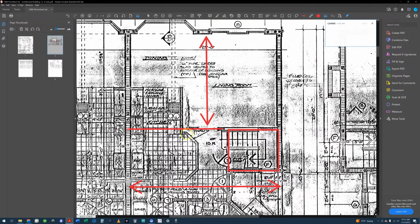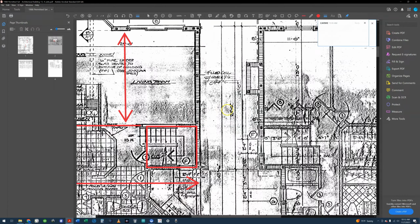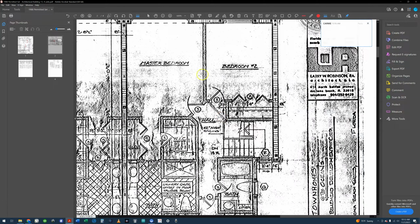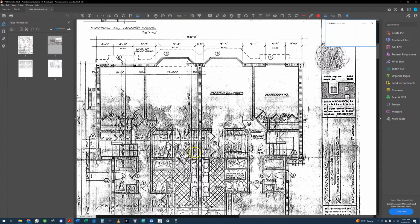Whether it's this wall or this wall doesn't really matter. These are non-load bearing walls. The only thing I can see that you would see any bowing of the wall, even going upstairs, there's no weight on the second floor that should be bearing on this wall. The only weight would be the dead weight of this partition. 8 feet tall, maybe even 9 feet tall. It's 8 pounds per square foot, which sets 64 pounds per linear foot.